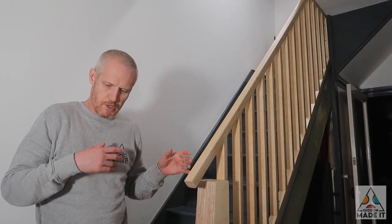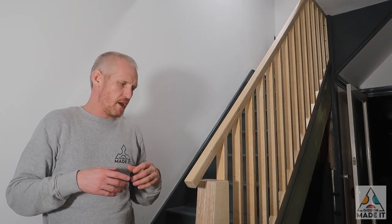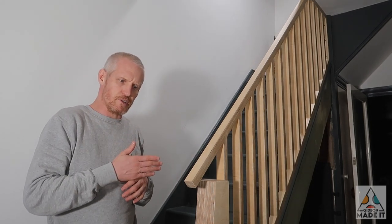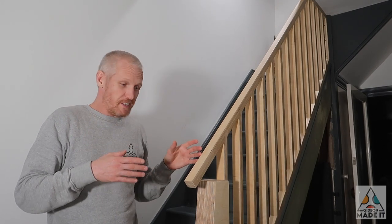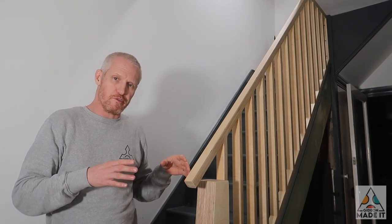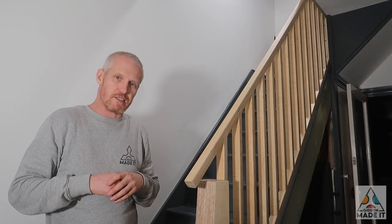For material I decided to go with birch plywood for a couple of reasons. It comes in sheets of uniform thickness and size, making it easy to work with, and it's stable. I've also used it in quite a few pieces of furniture throughout my house, so maintaining that continuity of material was important. Up until recently it was quite cost-effective, but due to inflation from COVID and sanctions against Russia because of the war, prices have almost doubled.